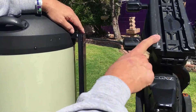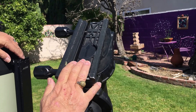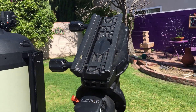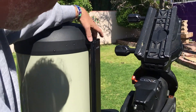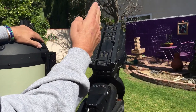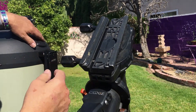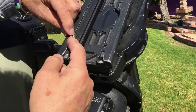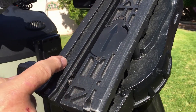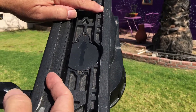The second thing is back up here on the saddle. You would guess, and most people believe, that these are straight. Well, the problem is these could be a little bit out if the screws are off by just half a millimeter or so — then you're going to get an angle this way. That's not considered cone angle, but it's an error. How do you fix that? Shims. And in fact, it's good I did this because my daughter and I just noticed that the other shim up here is loose, so I'm going to put it back on and glue it down.